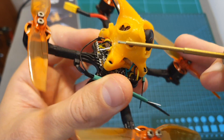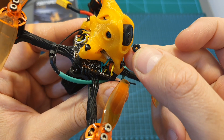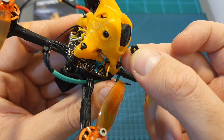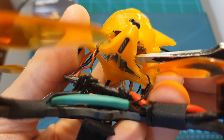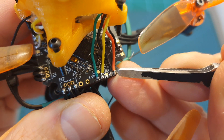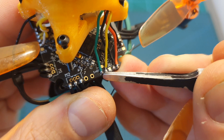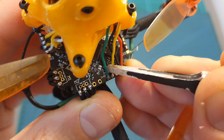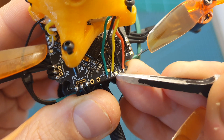To install your radio receiver you will first need to remove the canopy by unscrewing the four M2 screws. Be careful while removing the canopy since the flight controller is soft-mounted using rubber spacers. I mounted the FRSky receiver under the VTX and soldered its connector to the 5V, ground, and inverted S.Bus pad. If you'd like to use a DSMX receiver which uses 3 volts, you can use the 3V pad to power it and the uninverted pad linked to RX1.